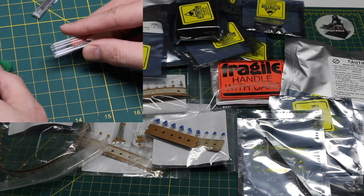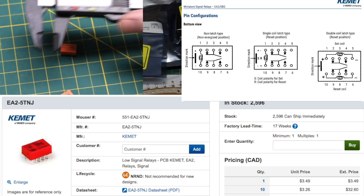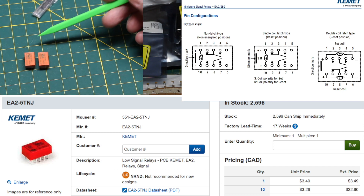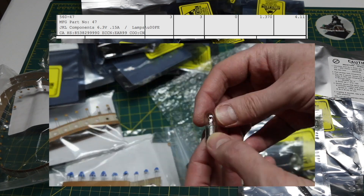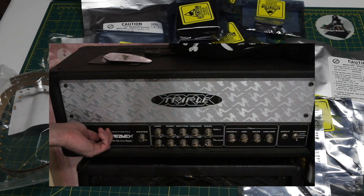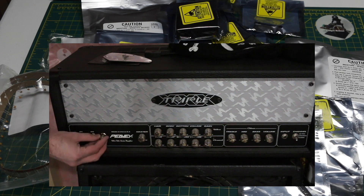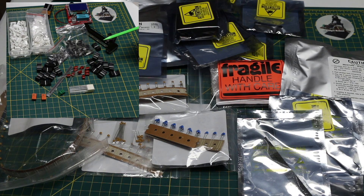These little relays are latching coil relays, 14 millimeters long and about 9 millimeters wide — a lot of them could be stuffed on a circuit board side by side, and these are low-signal relays, so good for audio. These are incandescent light bulbs, 6.3 volts — this goes in a guitar amplifier where the bulb burned out, so I threw them on the order. This wasn't my first choice of part number but the other one isn't in stock, of course. I bought three so that should get me through. Thanks to Patreon and channel supporters for helping make all this possible — check back and see what projects I come up with.